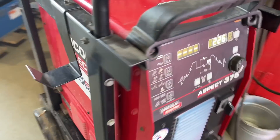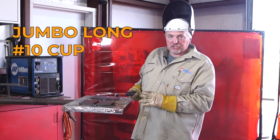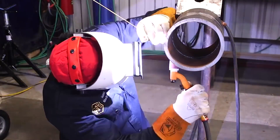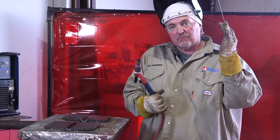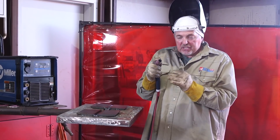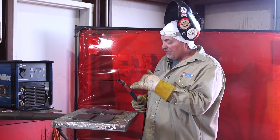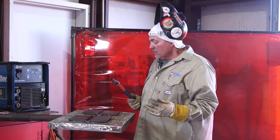Today we're welding with the Aspect 375 Lincoln power source. I'm running a 1/8 inch 2% thoriated tungsten and a number 10 extra long jumbo cup, which when welding flat really helps — I'm not choked up on the plate. A TIG rig was originally designed to weld around pipe, so the cup configuration allows me to work the cup better and manipulate the puddle. Being a welder working 10-hour days is about being comfortable — if you're not comfortable making a production weld, you're going to be thinking about getting out of a bad situation rather than making a good weld.